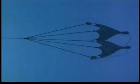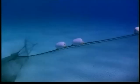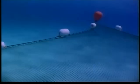Using 300-foot bridles with a tongue wire spliced halfway up the outside bridles, the twin 48-foot mongoose nets shown here are spreading 60 feet with a head rope height of 10 feet. When five bridles of equal length are used, the trawl spreads 70 feet with a vertical height of 9 feet. The spliced bridles caused a 10-foot decrease in spread.